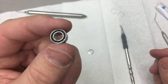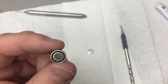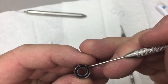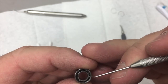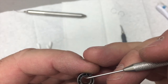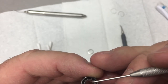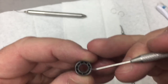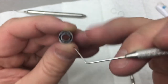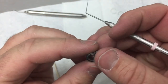You can actually see down inside there — you can see those ball bearings down in there, and they're actually set inside of a plastic ball keeper, a cage I guess is the technical term. But they turn around, and as I move them around in there, I can feel that it's kind of grainy. So we're going to try to figure out if we can get those actually out of there and keep them inside the race, and clean everything and re-grease it, or do we have to send it back to the manufacturer? So let's take some time and try.